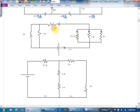And this is an important number because look. Is that not all the skiers? Does not every skier have to go down this hill? Follow it. Do all the skiers join back together? Do they all follow here? There's my total current. See it? Total current, Dylan, is 5 amps. Now I can go back and fill in some blanks. If I had 2 amps right here and 0.5 amps right here, how many skiers went down this ski run, went through this resistor?